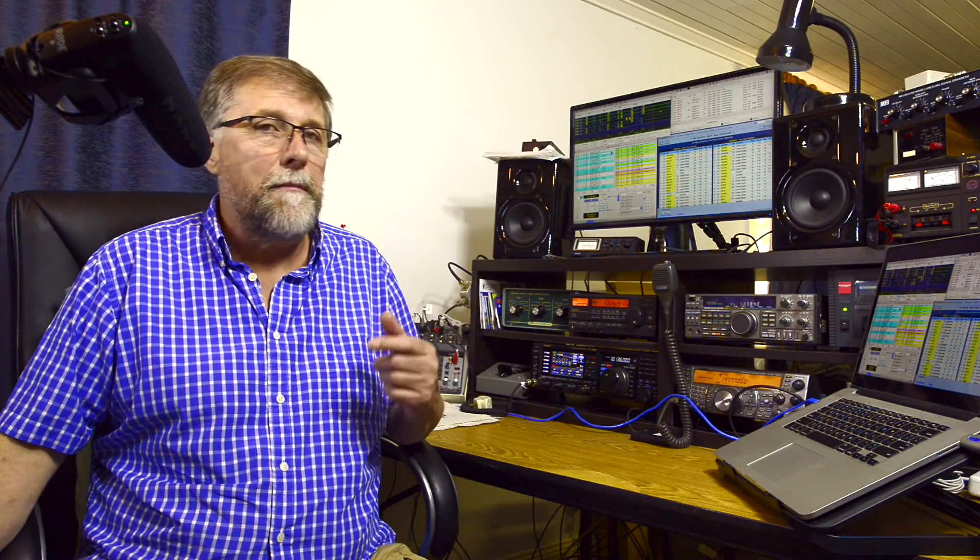The notch filter can be a really handy tool for blocking out a plus 20 dB signal from a very strong local amateur station. While it will also potentially block out weaker signals operating very near that frequency, it does mean you don't have to wind back the RF gain quite as much for that particular station. On many rigs the width of the notch filter is adjustable, and on a narrow setting it can be extremely effective, especially with FT8 signals that have a bandwidth of less than 50 Hz.